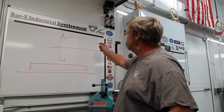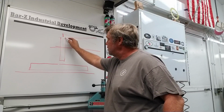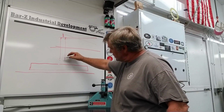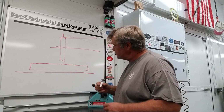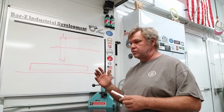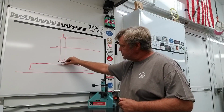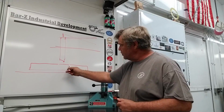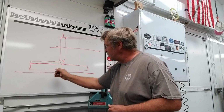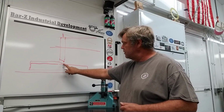So what if this thing runs at this angle? What's going to happen to our wheel? Our wheel's going to dress at a slight downward angle, and our wheel's going to be shaped like this. And when we're grinding, what's going to happen to our grind? We're going to only be touching at this edge right here. If we're traversing this way, our work's going to be matching that like this, and we're creating a wedge and working our way across at an angle when we traverse this way.